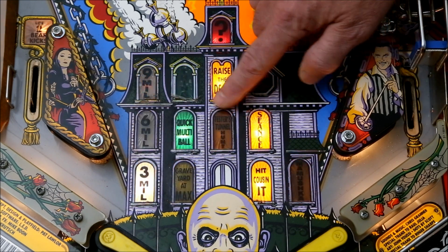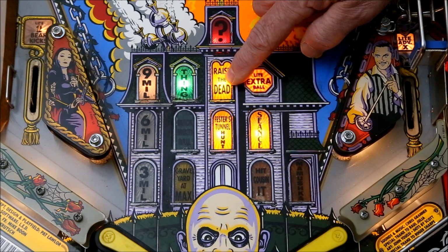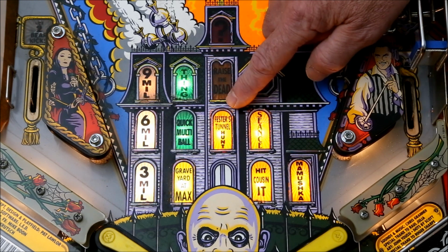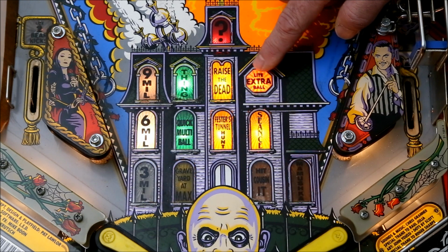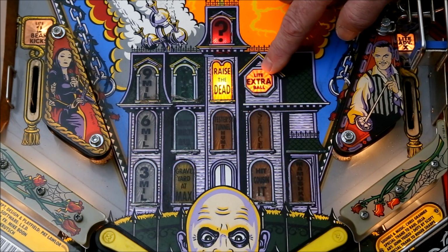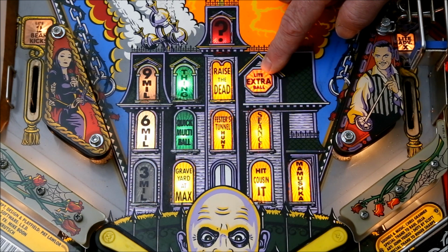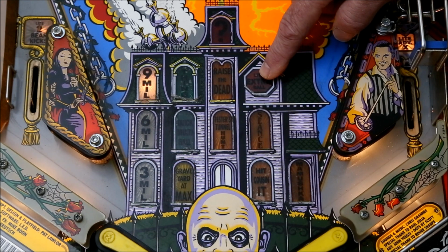What the rest of the lamps show is that the LEDs are much brighter and for the most part make the colored lenses more intense. The only downside is that the lamp under the red lens washes out the red so much it almost ends up looking orange. Next, let's swap out all of the lamps under the colored lenses with LEDs of the same color.